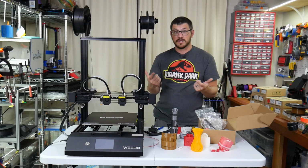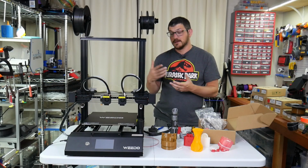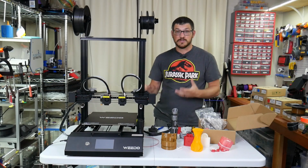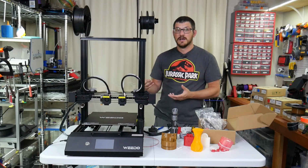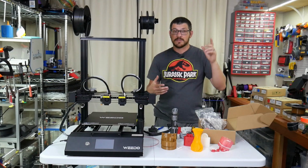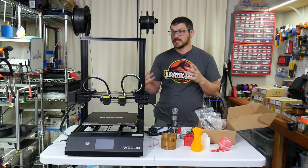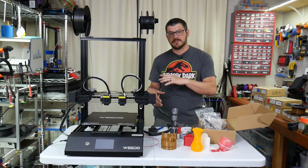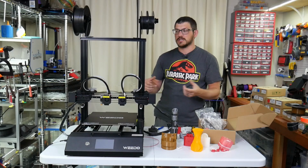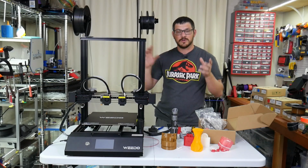So yeah, the software is pretty bad, and I'm just using Prusa Slicer, and mainly I want this for the 2 color prints because there's a lot of things I want to print in multiple colors, but whipping out the palette, because I have the Palette 2S Pro from Mosaic, that's a lot of setup. The slicing is honestly difficult, using Canvas and then sending the objects to the Raspberry Pi controlling the printer and the palette, and then having all those colors set up.